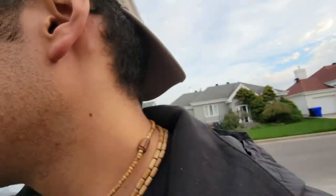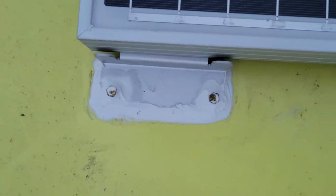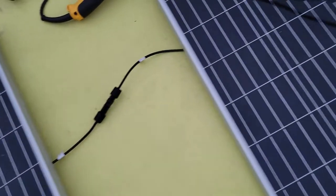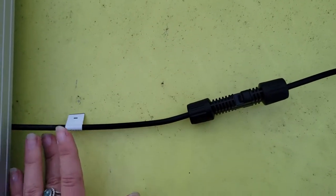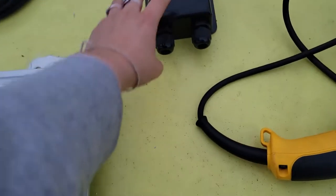What up nerds — we're going to continue installing the solar panels. It's a beautiful day! The first panel is set up — this is how it's going to look. It's stuck on with Gorilla Glue, drilled in with metal screws, and caulking around all four. It's going to be wired in parallel — positive and negative together for each panel until the end, with one wire coming out from the first panel and another from the fourth, both going into the junction box.